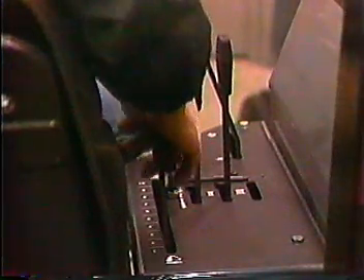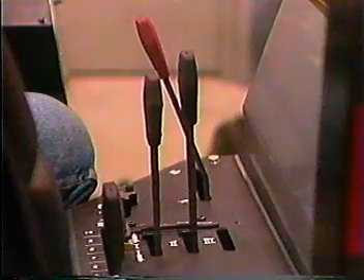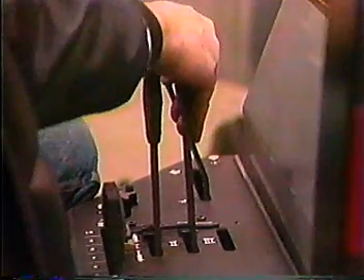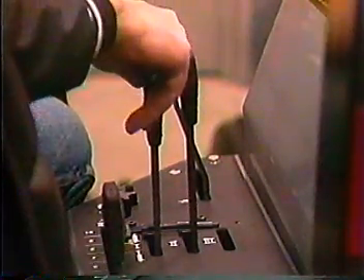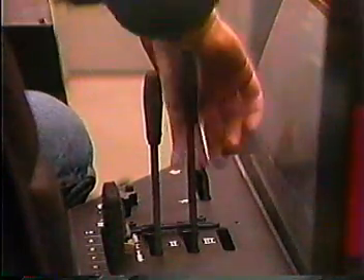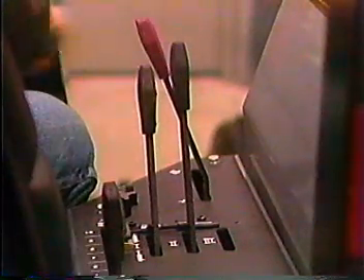When checking the three-point hitch lever, it must have enough resistance to retain its position — adjustment is made with the friction nut. Move the power takeoff lever to the engaged position; it should return to neutral position when the engine is not running. Move the hydraulic levers — they actuate spring-centered valves in the raise and lower positions. When the levers are released, they should return to neutral. With the float position lockouts turned forward, the valve should go into the detent float position.